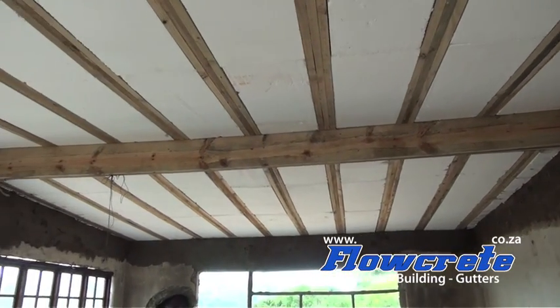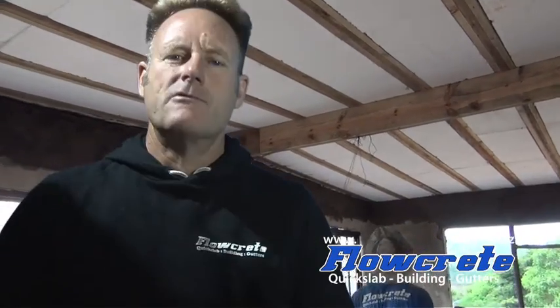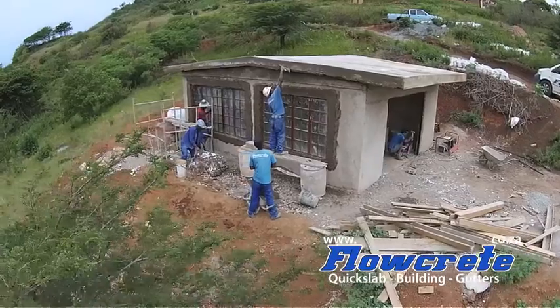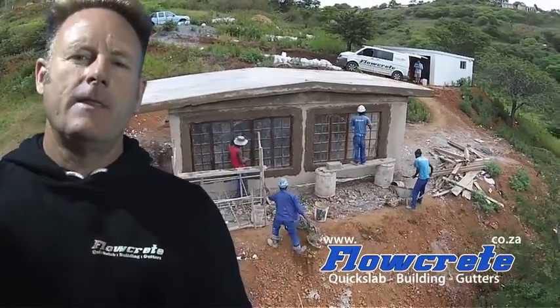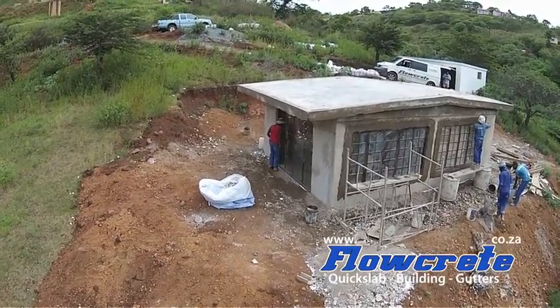That's the main support that runs across the top of the roof, keeping the rafters in position. Rafters are then fitted with polystyrene voidformers that clip on. Mesh reference 100 is then laid on the polystyrene sheets and screened with a 40mm cement and river sand mix. The roof has a very shallow pitch under 6 degrees, which allows for the easy fitting of solar panels and solar geysers.